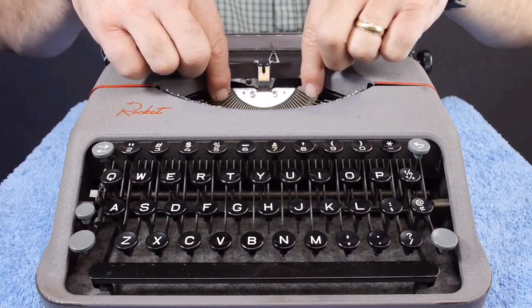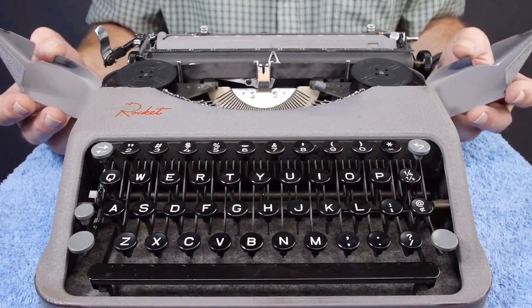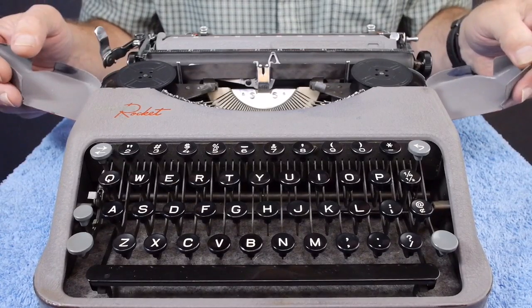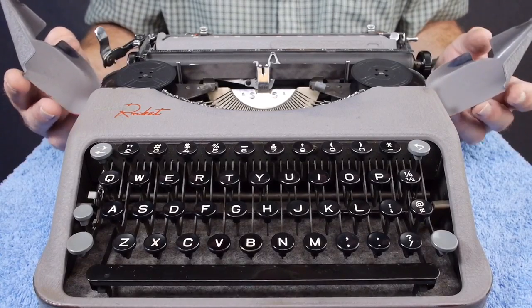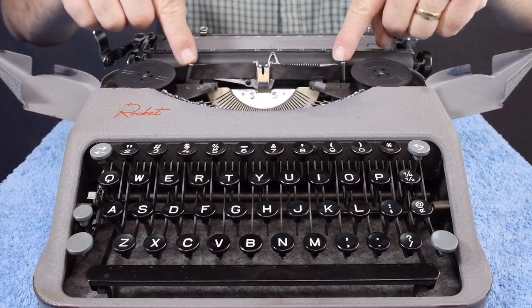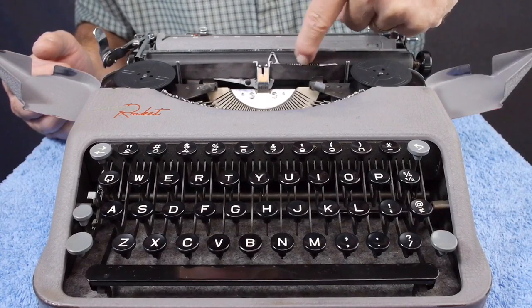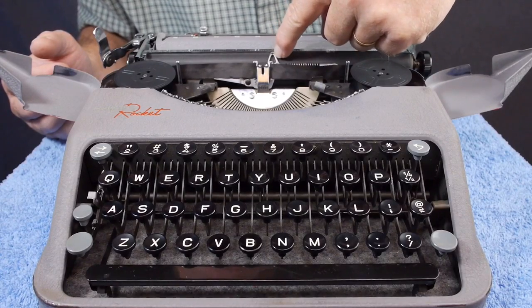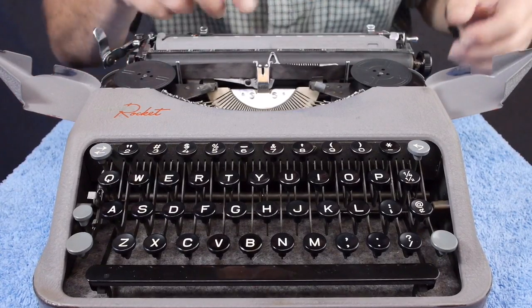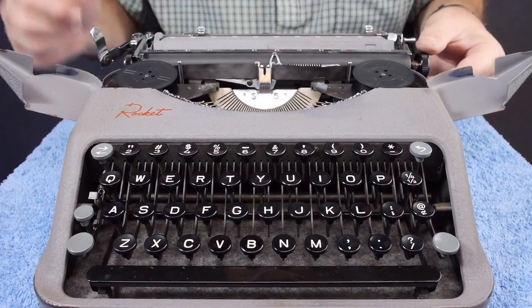In the segment area in the middle of the typewriter, you have the two ribbon cover half-covers that hinge back. They're very thin but rigid metal — the whole body is stamped from sheet metal and has kind of a military look. Here are the ribbon spools, and they go through these little guides. It has an automatic ribbon reverse. There is a little scale here and a triangular protrusion for supporting a business card with a hole in it, so you can move the carriage back and forth and draw horizontal or vertical lines on your paper.